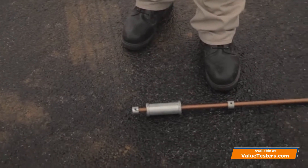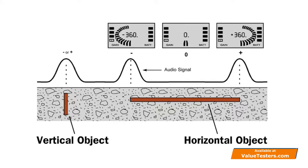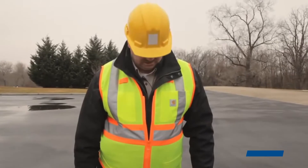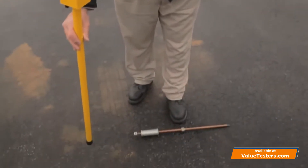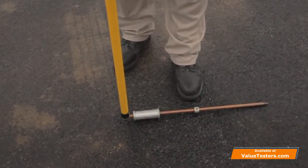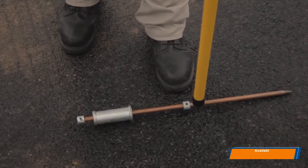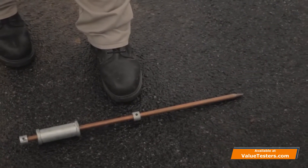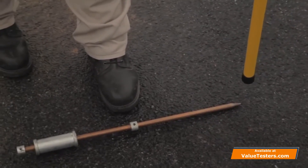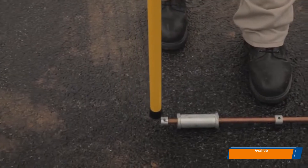On the ground is a horizontal target made out of steel. This is a ground stake, and it has the properties of having a magnetic field on the opposing ends of this stake. I'm going to demonstrate the 52CX and show you by the tones how it reacts to the magnetic field on the opposing ends. The tone goes up when it sees one end of the stake, it will quiet over the midpoint or the neutral part of the magnetic field along the object, and it will rise and peak out on the other end. If you go beyond the edge of the target, the tone goes down. This is where the distortion of the magnetic field is created on one end and on the other end.